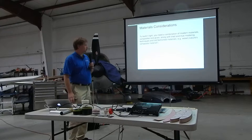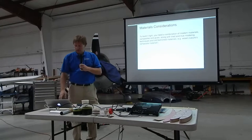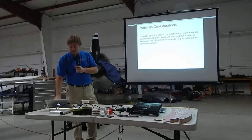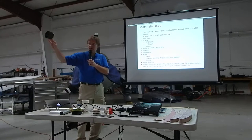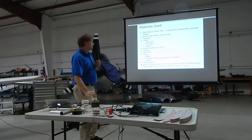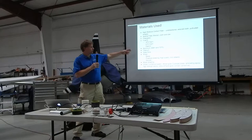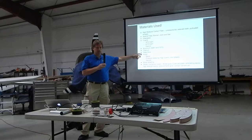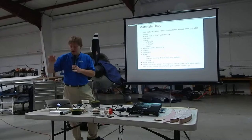In terms of materials, we had to use modern materials — composites and glue — along with a lot of tried-and-true modeling techniques to make this work. It's really like building a gigantic model airplane using some pretty high-tech materials. We use things like high modulus carbon fiber in the spars, a lot of Kevlar, some fiberglass, lots of foams. There's a little bit of metal: aluminum, titanium, steel wire for the lift wire. And then a lot of wood — balsa wood and very thin plywood — along with various types of glue, and mylar covers the whole thing.